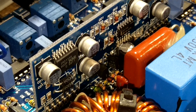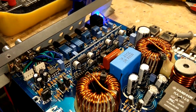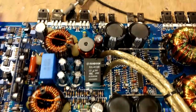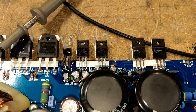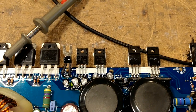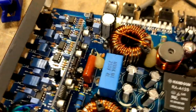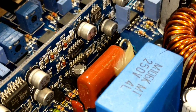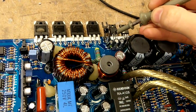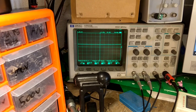So the fault is either with whatever is providing VCC to the IR2113S, or with the chip itself. To determine which it was, I started looking at the components that generate the low-voltage VCCs that power the chips. Over here we have a couple of what look like transistors but are actually voltage regulators — labeled KIA 7815 and 7915. These generate plus and minus 15 volts and power many chips including the op-amps in the preamp section and the chips on the Class D generation circuit. We can verify these by measuring their outputs — on the 7815 output we have 15 volts.